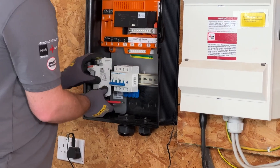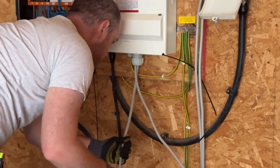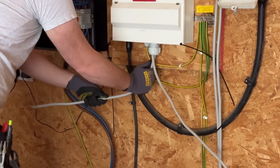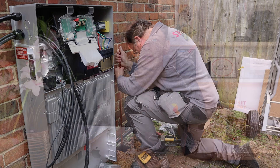There are a few things that are saved as a result of this. Firstly, the Gateway itself is not required, which saves quite a bit of money. It also saves a lot of electrical labour. Part of the Gateway installation involves wiring the tails from the meter into the Gateway, which takes time and can be a real faff if the Gateway is not mounted close to the consumer unit or the meter. When you do install Powerwall with the Gateway and power cut protection, your installer also needs to knock an earth rod into the ground — this is so that the system is earthed in the event of a power cut. If you're not getting a Gateway with power cut protection, then this cost doesn't come into it either.